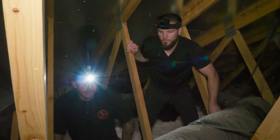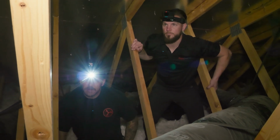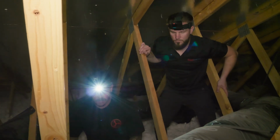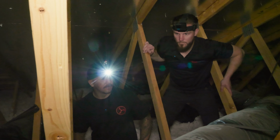It's just an appliance with a cord with a plug on it. So the first thing I notice is their FAU's mounted in the attic. It's a 20 amp circuit that's available for us to use. Being that we don't run our QuietCools with our AC simultaneously, that circuit's wide open for us.